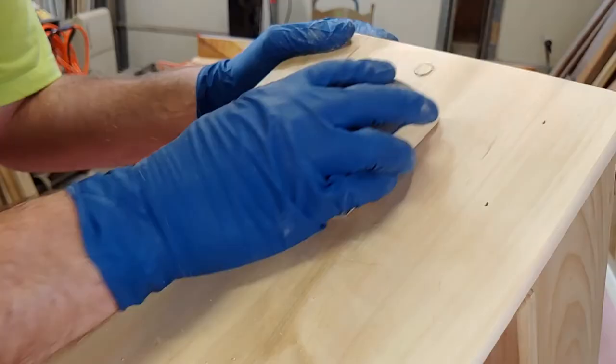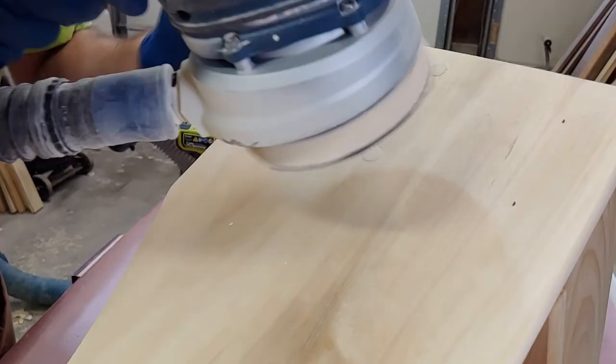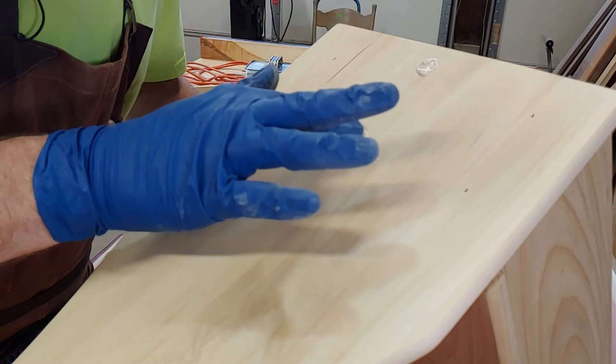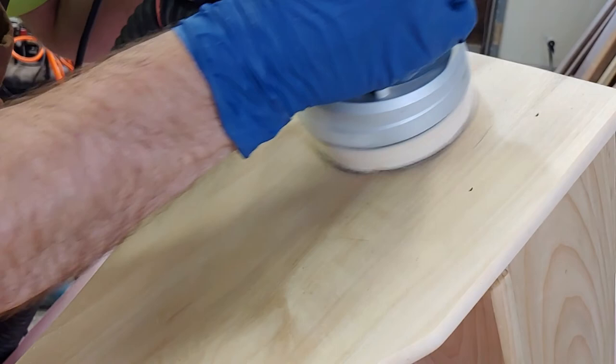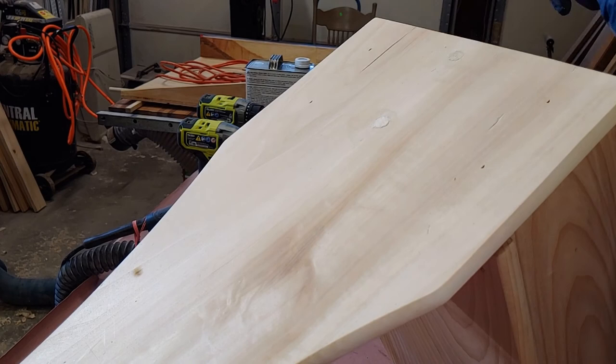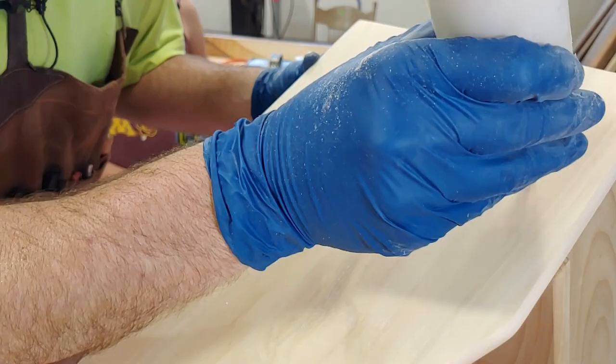It's not completely flush, but that's why we have sandpaper and chisels. I sand it down to get it closer to level, then put some wood glue around any gaps — it was a pretty tight fit but there were still gaps. Sand fills in all those gaps, and when the glue dries you'd never know. Use a chisel to get it a little more even since it was almost dome-shaped. A little more sanding, a little more glue where I messed up, then fill the little brad nail holes with glue too and sand over those — easy filler.